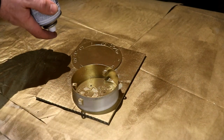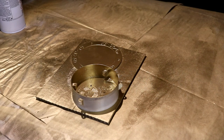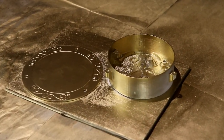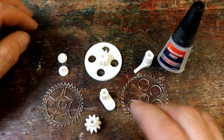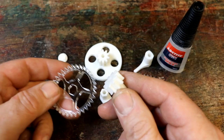When you have finished spraying, turn the can upside down and just give it a little short burst to clear the nozzle. Then leave the paint to dry — for this particular paint, probably about ten minutes, and then it's ready for another coat. Far better to do two or three coats than to absolutely swamp it because it'll run and take days to dry. The next thing is to assemble the gears and the crank. You can glue them all together and then paint them all the same colour, although I'm going to explain how you could paint the central gear a different colour to the outer gear.